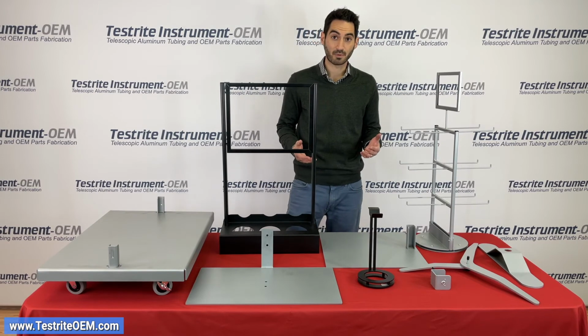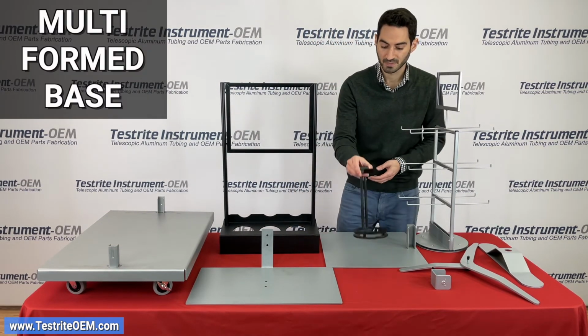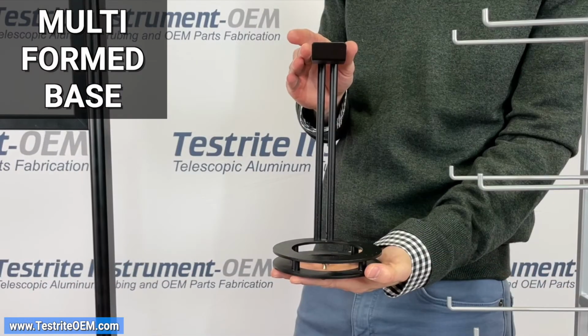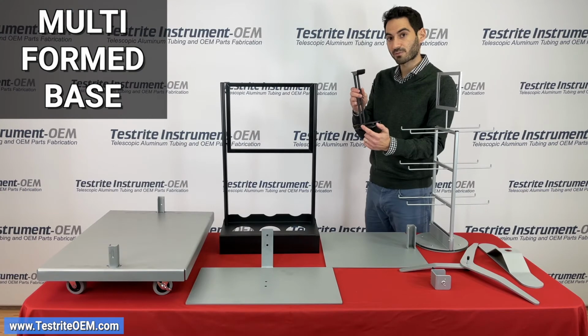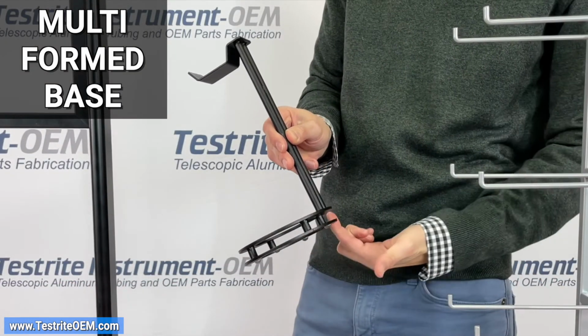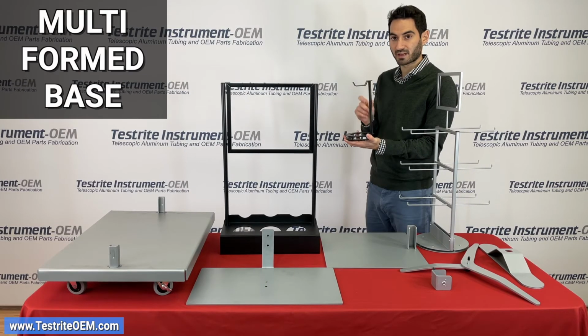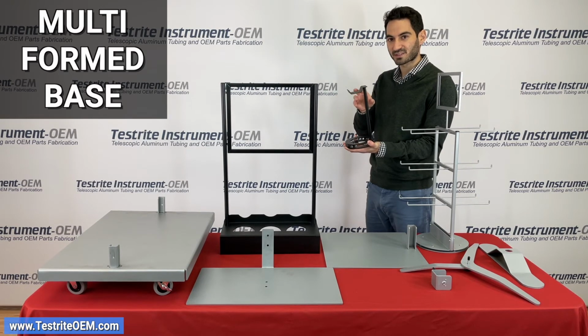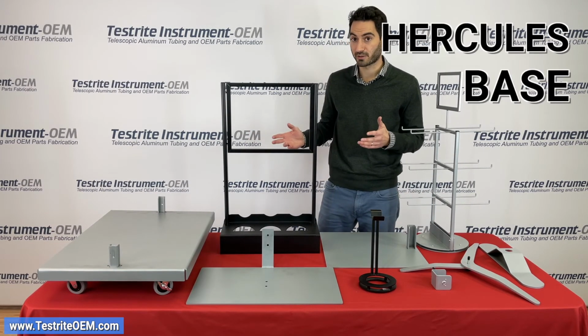So I have another example where we're using a variety of Testrite capabilities all together in one product. So this includes laser cut bases. There are actually two of them, and they're joined together by steel pins that are welded top and bottom. There's steel uprights, and then you have a formed plate at the top. So this is actually a variety of different steel plates and bases all attached together to create a very unique item.